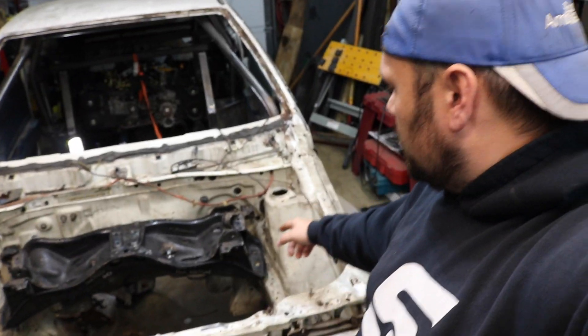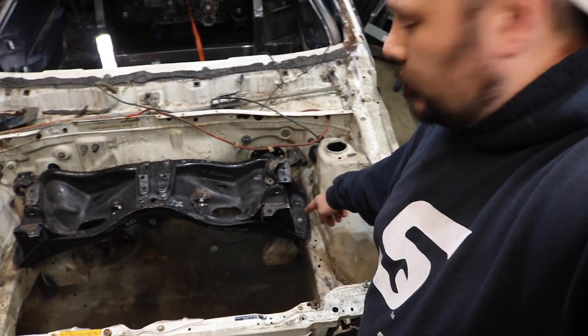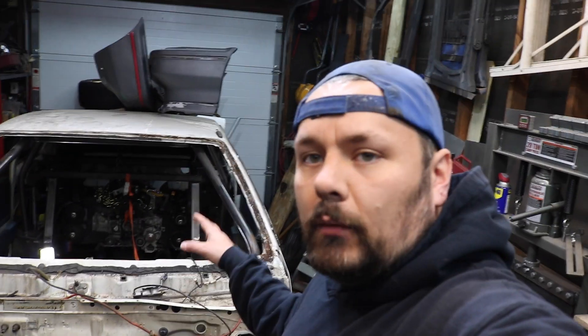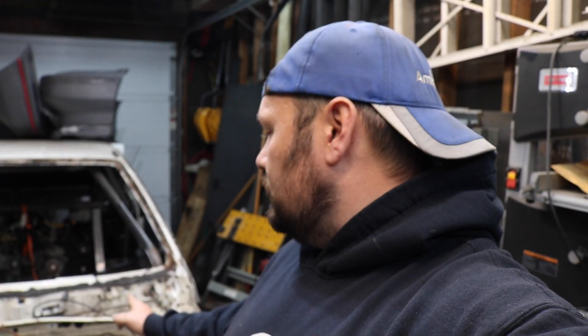So that's just the way I want to do it. We are going to be cutting out basically the entire insides of these frame rails. We're going to leave the outer structure for now where those tubes meet the bulkhead, get those notched out, and then we're also going to notch this front apron just basically enough to allow the rails to slide into place.